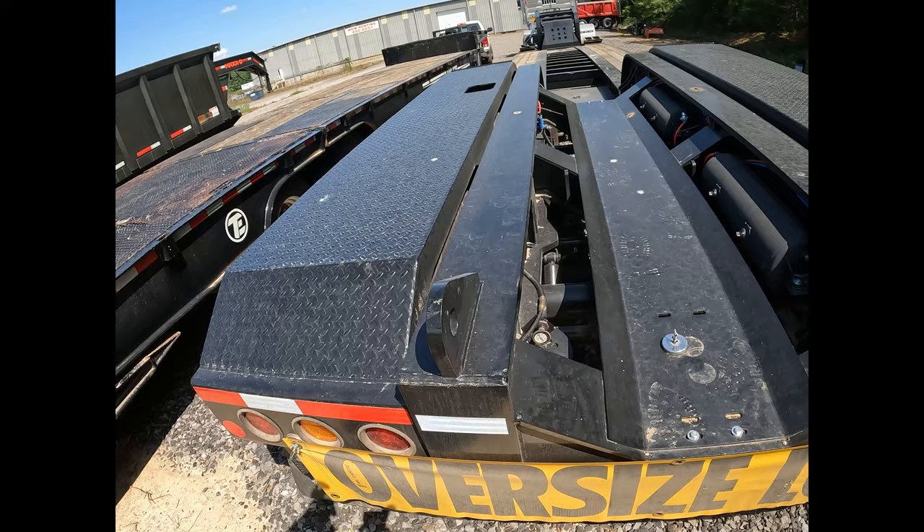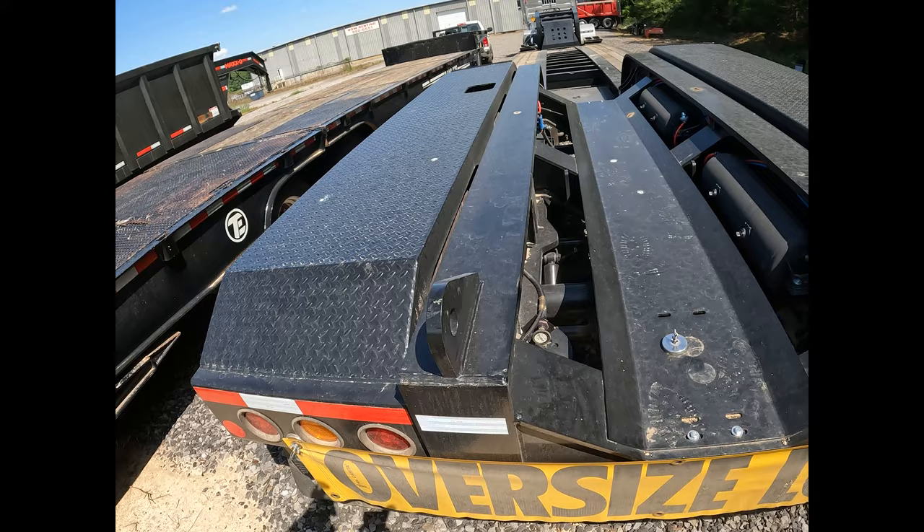You already have air coming to the back of your trailer filling up your tanks, so when you go to lift your axles you don't have to do a whole extra step — there's already air in the tanks. Then you can click your light on, which is your blinkers, and you're ready to go. That's how you disconnect and reconnect from a Fontaine 55-ton, and this applies to just about all the Fontaine trailers.